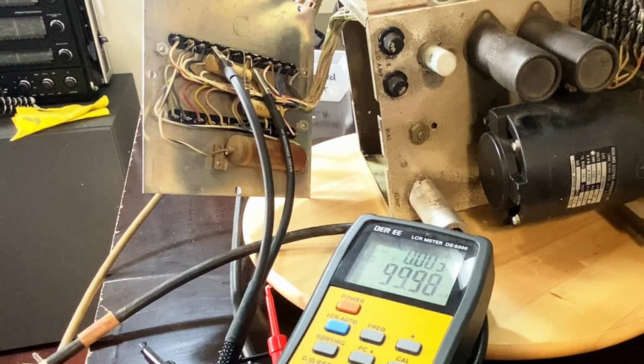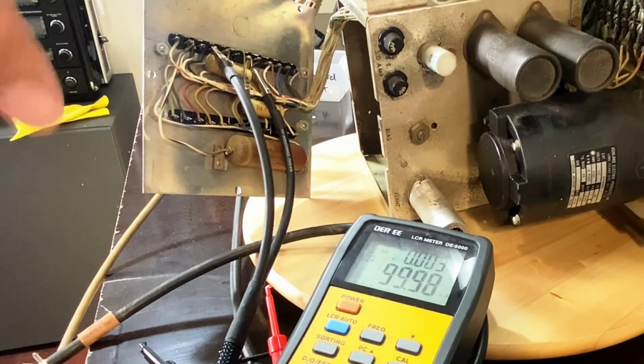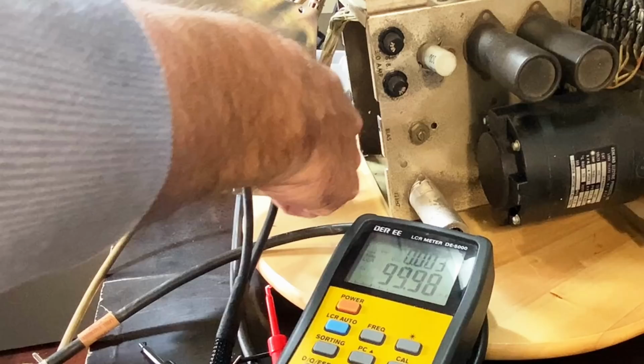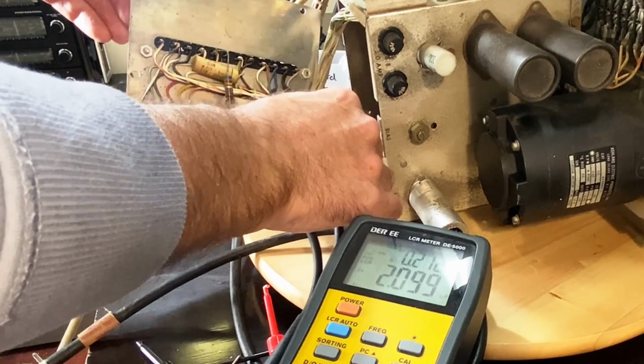So what I'm hoping, really hoping, since the schematic does not match the one I've got, is that the components are all of this standard. And I can actually go through and just clean it up and really sort of troubleshoot by testing it, by switching it on. I'll still need to do a bit more testing, but this capacitor here is a 2 microfarad capacitor. It looks like the sort of capacitor you'd need to change.